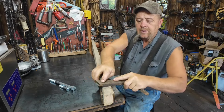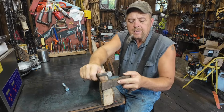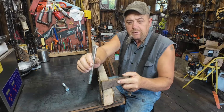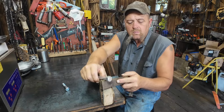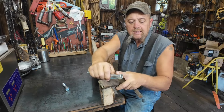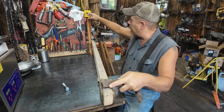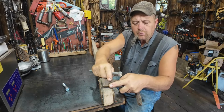This is just however long this happened to be. And I drilled a hole in here, press fit for a 5/8 bolt. You take your pick, and then I drove it most of the way through, and I used a grade 8 bolt. This is just a grade 5 I'm showing you. Did a press fit hole, smashed that through there, welded it up good on one side, cut the head off, and welded it on the back side. So this one here is welded inside and outside and press fit. It ought to be okay, and it's in pretty thick metal.